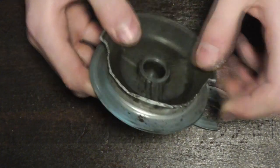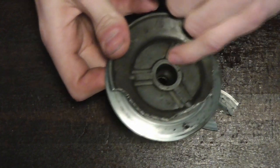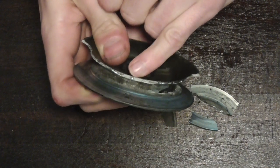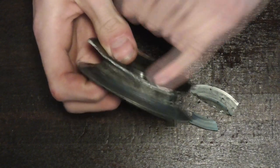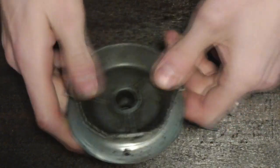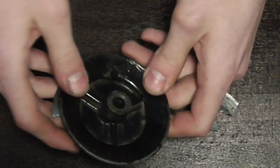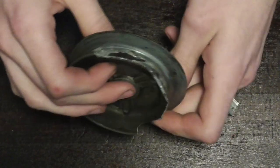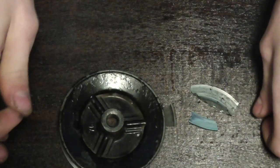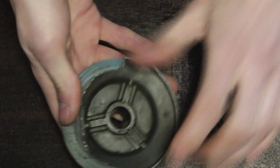You may notice that the casting isn't the best quality either — even down here it's pretty porous. When you look at the breaking surface you can see bubbles right where the pieces broke off. My guess is that it was sufficient for parade driving, Sunday 30-kilometers-an-hour rides, but when I beat this thing onto the autobahn, well, that was it.